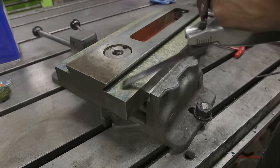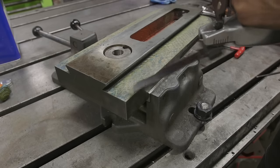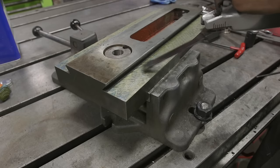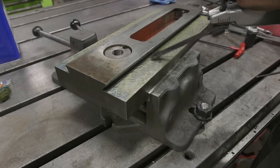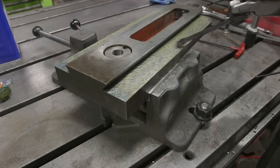As for stroke length, we have this set to a medium-ish stroke length. Ideally I'd rough with a longer stroke, but being close to the dovetails a super long stroke can be problematic — it wants to dig into the corners. Later we'll turn it down a little and get finer as we go, but for now this is working out really nice.